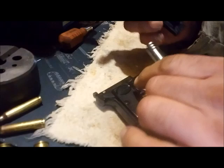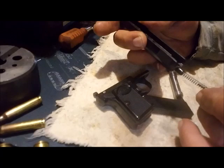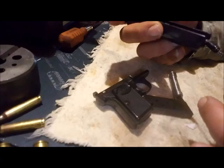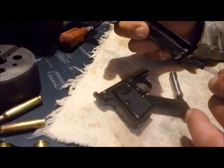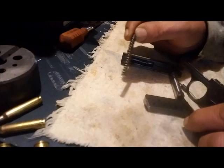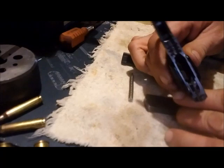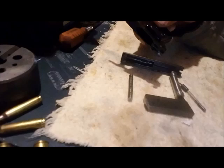The striker is also removable — the striker assembly. There's a little tab on the striker when you put it back in; be sure to line up that tab. Here we have the recoil spring and the guide rod. I do not recommend disassembling these parts further, but you can wash them in oil or Hoppe's as you see fit. And that's your basic pistol.